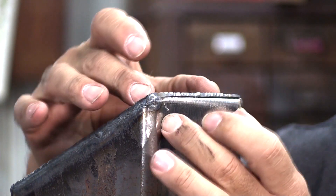So what do you do about it? There are really two ways to get around this. You're welding up a joint — it's your last joint, you don't want a blowout. You can use a foot pedal so you can get close to that end, and then back off on the heat a little bit, back off on the amps. The weld will cool down a little bit and you get that last tiny bit right there. Or, you can come up out of the way, just a little bit away from wherever you're welding, and drill an eighth of an inch hole — or a sixteenth of an inch — something small. Just enough to let it breathe, let the air move, let the pressure building up inside as you're welding escape. You can finish your weld, then come back to that hole with one little dab. You're all done.